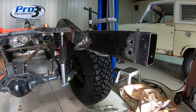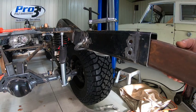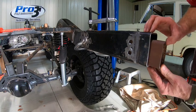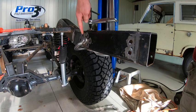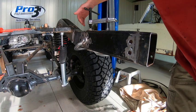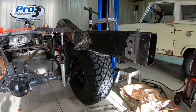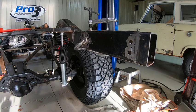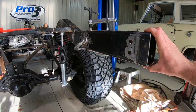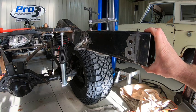To add some structure, I've got a couple of pieces — 18 inches long, two-inch by three-inch rectangular tubing — that slide in there and plug weld at all these locations. That'll add a lot of strength back here. Then again we're going to put fish plates on the inside and outside to strengthen that, and in the very back I've got a trailer hitch receiver that I'll show you how it's going to be welded on.